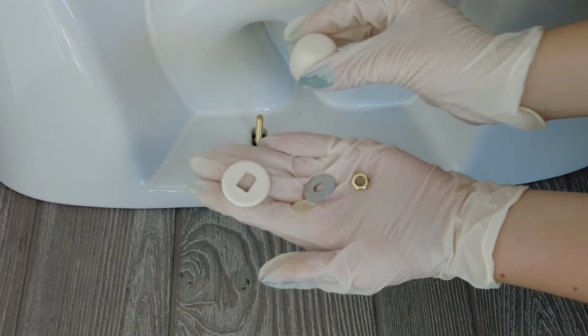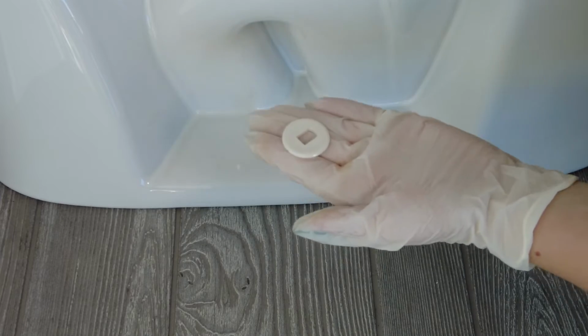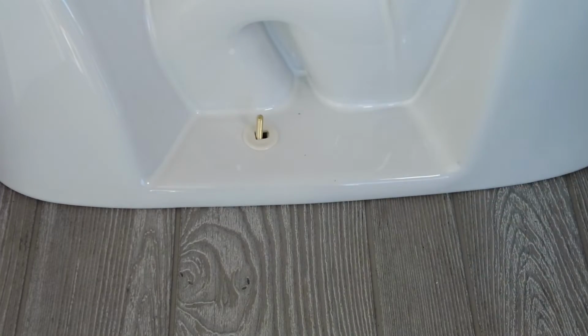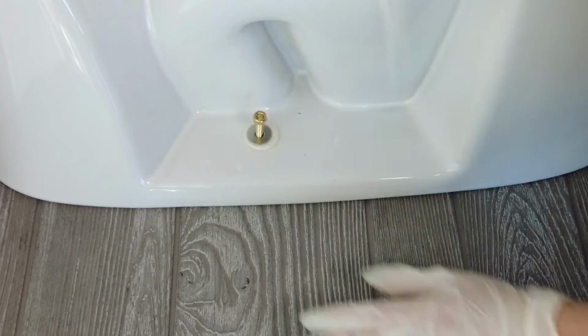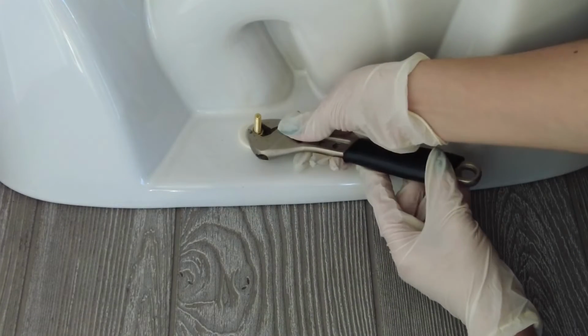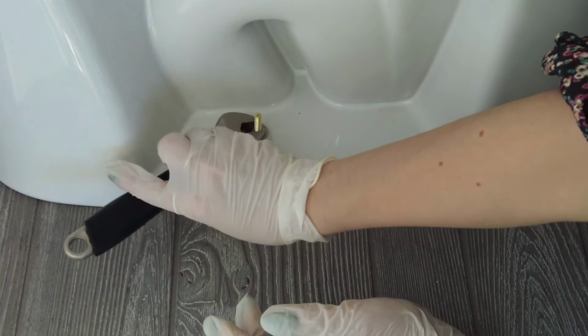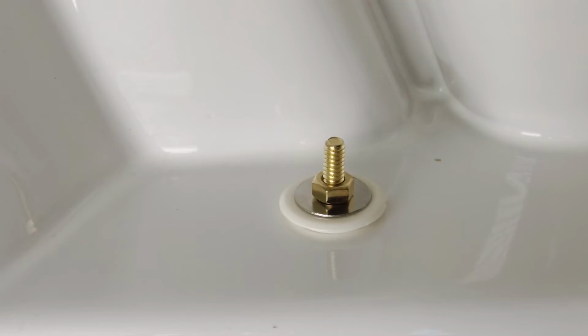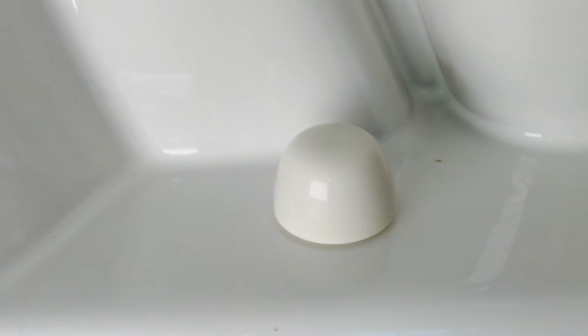Attach the three-piece connection kit. The base should be placed so that the rounded top faces upward. Then install the metal washer and finally the nut. Hand tighten the nut and then give a final 1/2 turn with a wrench. Do not over tighten. Now you can attach the decorative bolt covers. Simply snap them into place. Note that if you place the connection base upside down, the cap won't snap into place.